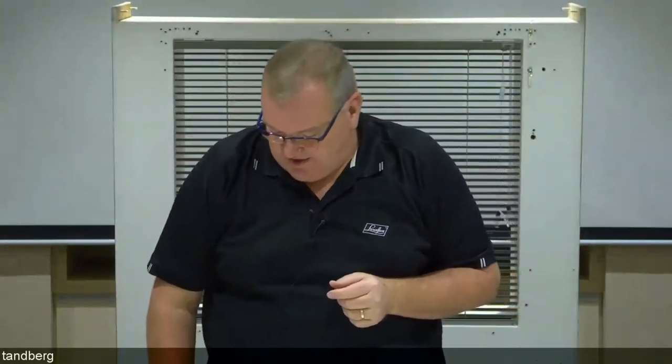You can call up end mount brackets. We don't use them very often these days. Obviously, they only come in this clear. They're not as nice as the other because you do physically see this fitted to the end. You do need to be conscious, though, if you are using these, there is a maximum width of 1 metre. So this tends to be an item that you'd call up on commercial jobs more than anything, on those jobs where we can only fit to the side of window mullions, can't actually fit to the top. So that's when they would be called up.